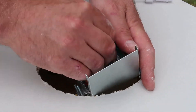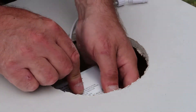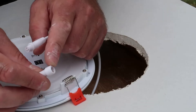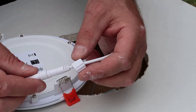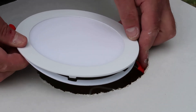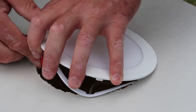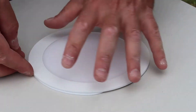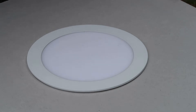Then start bending all your wires back into your box, get them all in there, and close the top of your box. Push it back up into your ceiling and it'll sit up in there, leaving the connector hanging down. Now comes the light — there's a little flat spot inside here and a little flat spot on the male end and they fit together; it's only going to go in one way. Tighten the little nut. The easiest way is to take one spring clip side, push it down, slip it into place, then do the other one. Make sure your little washer is tucked in properly — and that's it, you're done with that light.